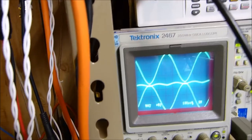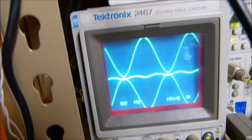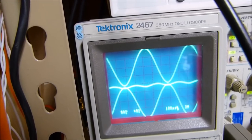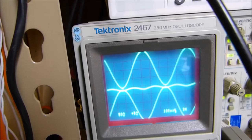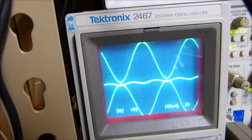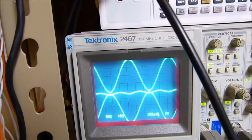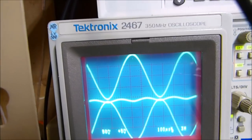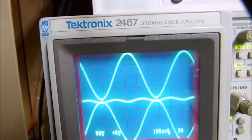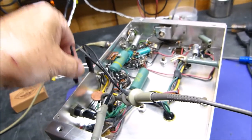With an oscilloscope, a two-channel oscilloscope, I hadn't thought about it, but you know, sometimes it's difficult to have all these pieces of equipment, but with a two-channel oscilloscope, you can actually make these adjustments by adding the two and trimming the added channel, the added trace, to zero. So there it is. Let me turn this little guy over. It's a pretty little thing.